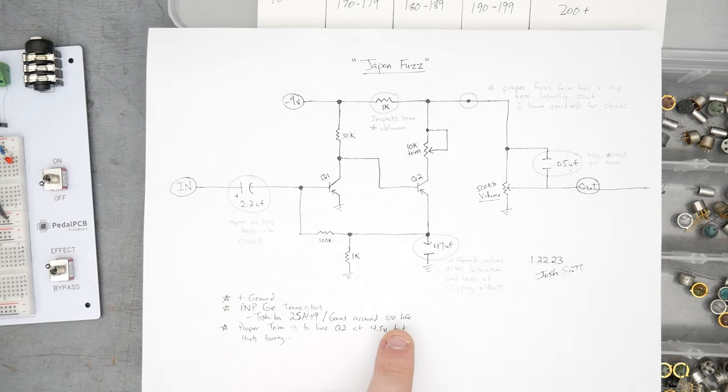And then just a quirk of this breadboard, there must be an output cap protection or something for the output jack, because I wasn't seeing the DC voltage I was expecting at the output. But when I just use a regular output jack, that works here. And we'll see that in a second. So that is the circuit.